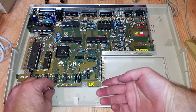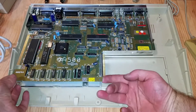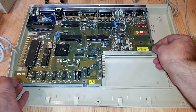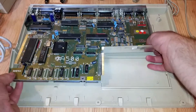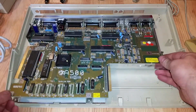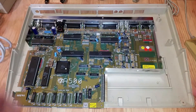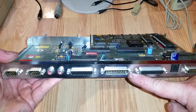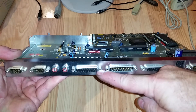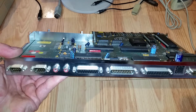There's a little tag here so you want to be careful when lifting the PCB out. If you just lever it up a bit the PCB comes out - it's a bit tricky at the back. You need to bring the RF shield with it; it lifts out with the RF shield and then the RF shield can be removed from the PCB. The PCB is held into the RF shield with all these little bolt holders along the back, so you need to take all of those off.